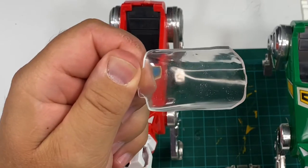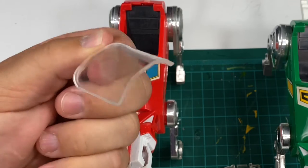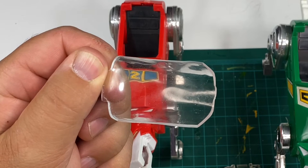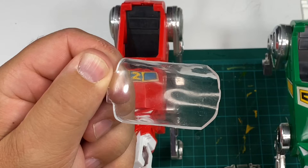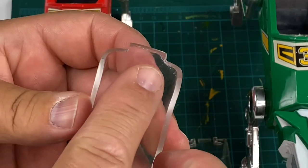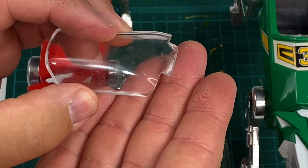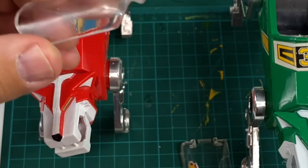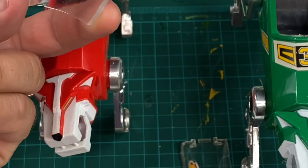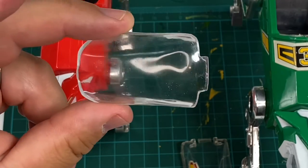And the thing about this acrylic is I heated this thing up probably a good 30 times until I got the shape I was looking for. And as long as you don't put it too close to the heat gun, it will not melt. I mean, it gets soft, but it won't melt. Now, there was a point where I did get it a little bit too close right here, and it did start to melt. I was about this far away. I got impatient. But as long as you're about 6 inches away, if not more, and you move it back and forth, it keeps the acrylic really nice. And it will turn a cloudy white, but then when it cools off, it goes back to super clear again.